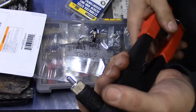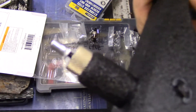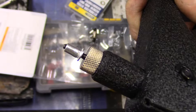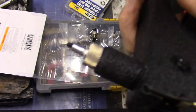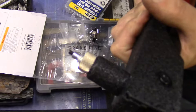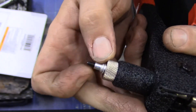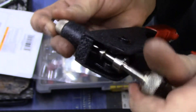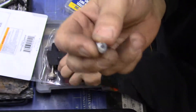You drill a hole through your work piece and then you squeeze the handle like this. You see how it ballooned out there? That little bulge there will hold your work piece in. I'll screw it on a little bit more and do it again so it gets even more extreme — squeeze — and look at that, you see how it folds onto itself. That fold would happen behind your work piece, which would hold this in place, and then you unscrew the riveting tool.